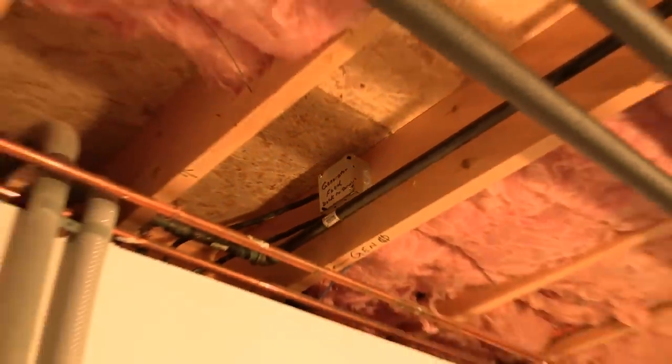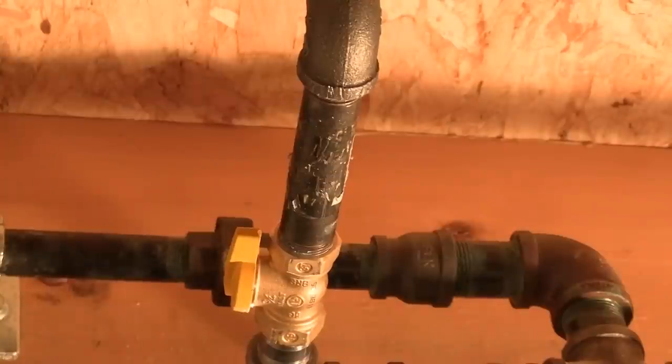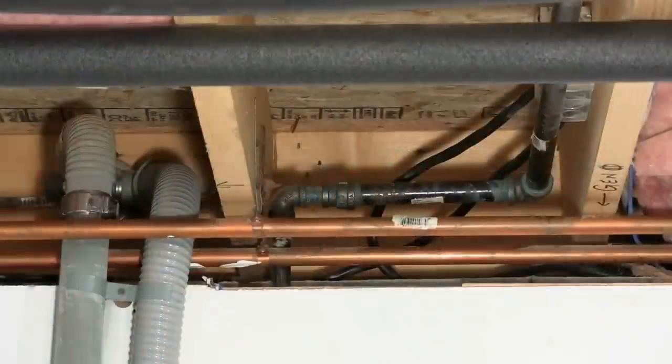So there we have it. I've repositioned that box to the other side of the bay, and I've exchanged that two-inch nipple for a five-and-a-half-inch nipple, which will give me plenty of clearance. The problem before was that if I got too close to that junction box I wouldn't be able to access it or take off the cover to service the wires inside if required some day. Now that it's out of the way I can shoot that pipe straight down about two inches from the joist, which will give me room for joist hangers.